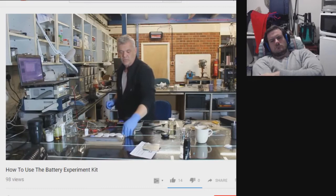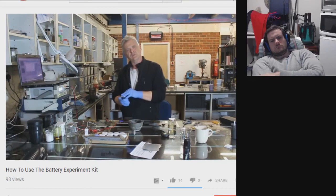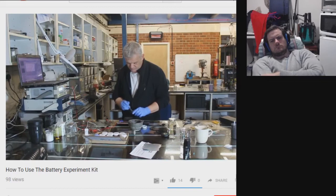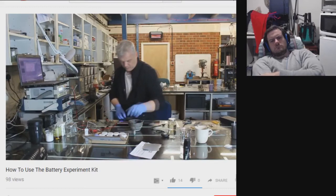Now, usually, a good guide to this is somewhere between 10 and 20% by weight of the conductive additive to your metal oxide. So we've got 1 gram here, let's say we've got 20% in, we need 0.2 of a gram of our 5 micron graphite, which is what I'm just adding now. There we go. So a tiny, tiny amount is actually what's needed. And this is going to make our metal oxide additive onto our electrode. So we can pop that away.